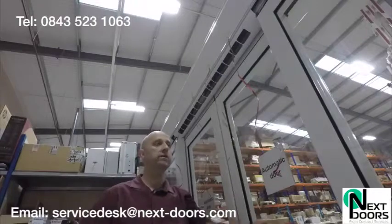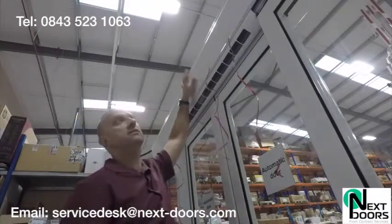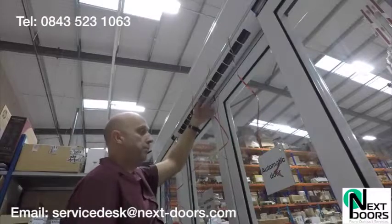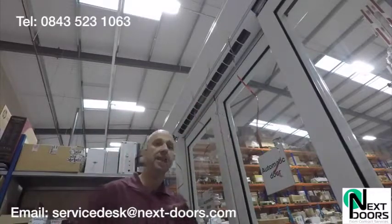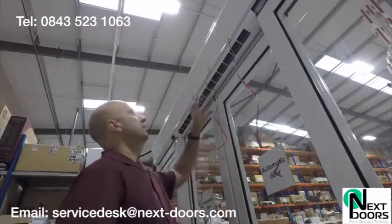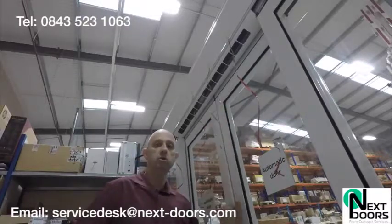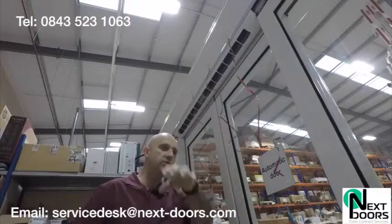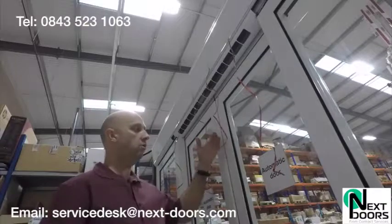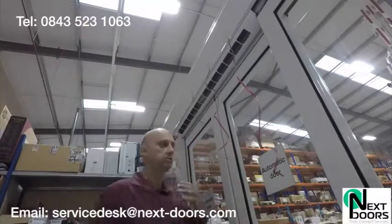It literally fits between the goalpost frame, and because of that we get that really nice curtain pattern pointing straight down. This is the exterior side — it's removable from the outside for maintenance and cleaning. That duct points the curtain immediately on the outside of the doors, which is going to be much more efficient. It creates that fantastic Bernoulli effect — that swirling pattern of air — to keep flies and debris out, stop heat loss from inside, and create a low air pressure outside so there's a positive air pressure differential.